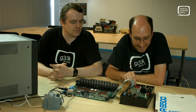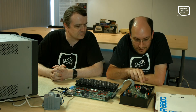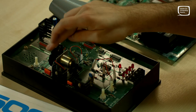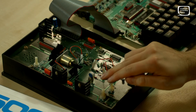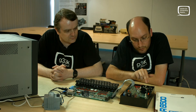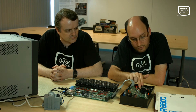There's a little motor with a fancy little fan in it. This disc with the notch has an opto-coupler at the bottom so you can detect that the motor is turning. The fan itself actually pushes the air forward and cools this little thermistor that's hooked up with two incandescent bulbs next to it, which will heat it up. The thermistor can be hooked up to an analogue to digital converter so you can find out just how hot it's getting and how much it cools when the fan turns on.